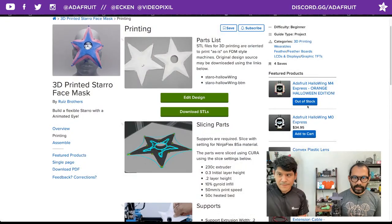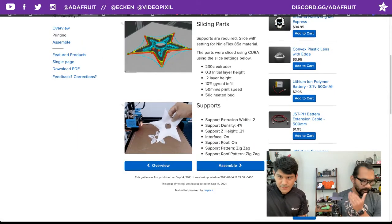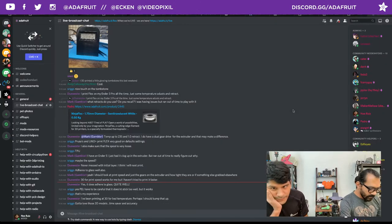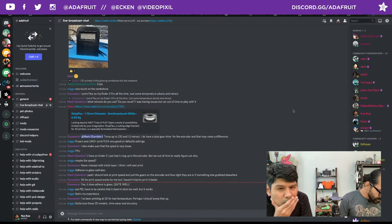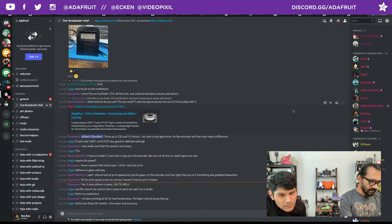I think that's it for the 3D printing portion. Any other comments? Yeah, just another plus on the 3D models: definitely a time saver. Before the integration of Eagle and Fusion, we spent so much time with the caliper measuring the distance between the standoffs, and there were lots more iterations that way, because we have to get them as close as we can.